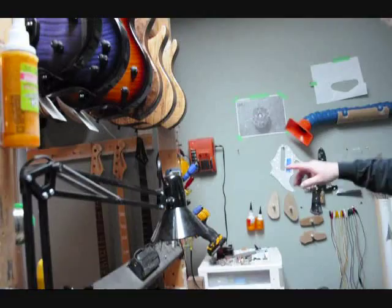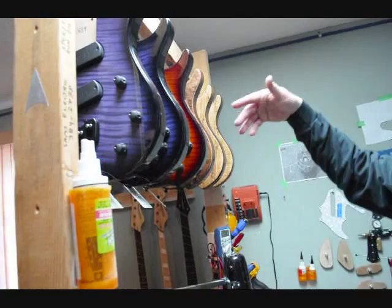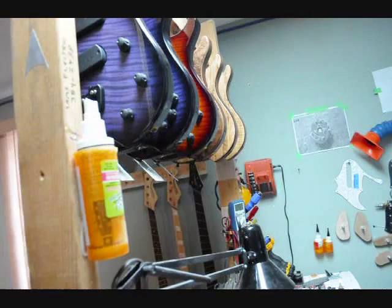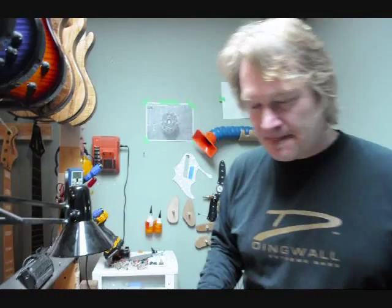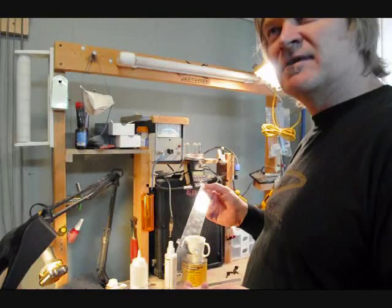Body assembly is primarily here, and it would be taking sub-assemblies like that preamp that I showed you, and inserting them in pickups, and then eventually the neck goes on here and strings and so on and so forth. Then a rough setup is done here, just the truss rod basically. Then the base will sit for a day for the truss rod to settle in. We've got this gauge here that we made. We tried to figure out a real quick and easy way of setting the truss rod. When it was just me, I'd do it by eye.